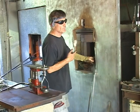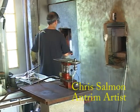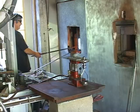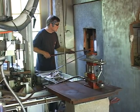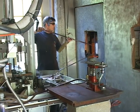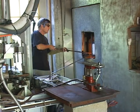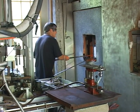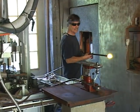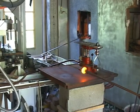Blowing glass using a pipe that originated 2,000 years ago in Phoenicia. Now the pipe is warm enough that the glass will stick to it. I'm going to go in here — I've got 120 pounds of molten glass in the furnace. It's about the consistency of honey, and I gather it on there just the way you get honey out of a jar.